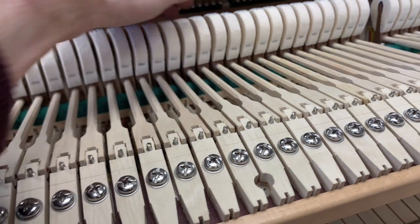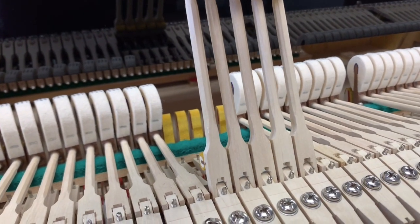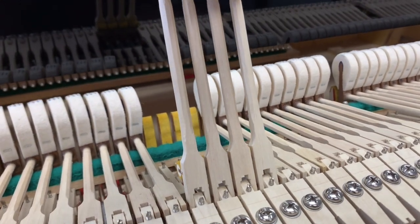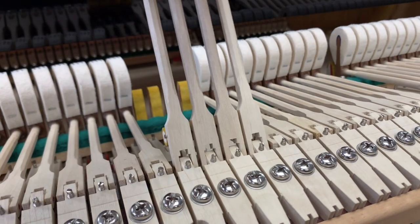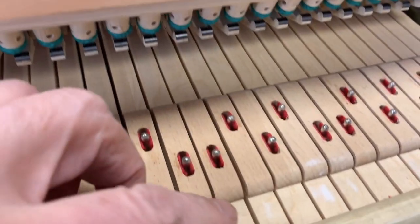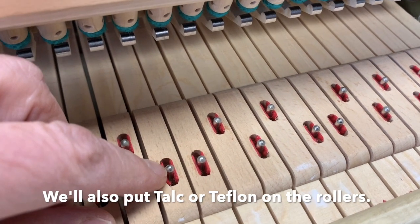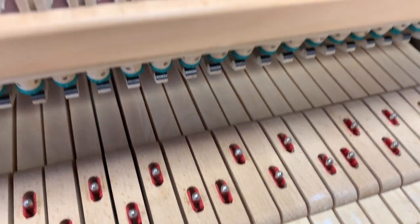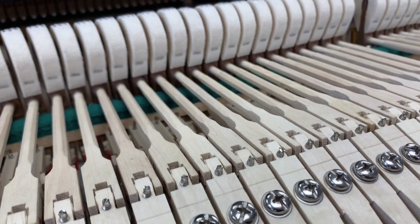The client who bought the Foric from us in 2011 lived in an older house. The piano was in the middle of a room, but it must have been perhaps slightly on the damp side. And if that happens, you get these hinges seizing up slightly. If we lubricate the hinges, we'll see how much that reduces the touch. We would also want to lubricate here as well, but you have to take the keys out. We use dry lubricant to lubricate the hole in the center — that's really important. It mustn't elongate the hole; just lubricate it with talc or Teflon.